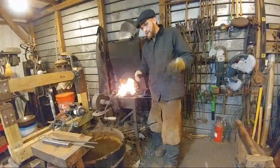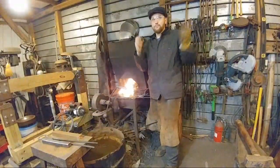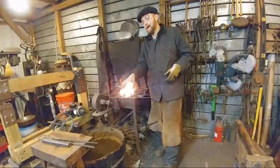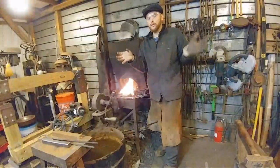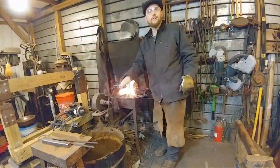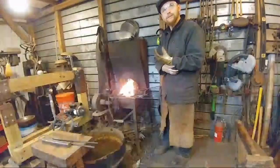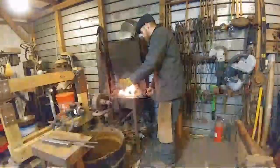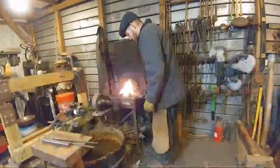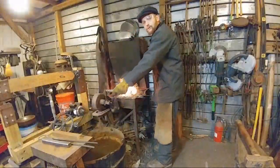But they do get really hot. The one thing I don't like about them is they do put off a lot of noxious gases out of the front end of them. You've got to vent them properly and or have them in a really open area. And so for those, I kind of got a mixed feeling on those. Maybe if I was doing big chunks of steel that I really needed to get hot, like welding temp, I'd do that. Yeah, For the Honor Forge says that he's considering making one for casting because of the cost of coal in Southern California. Yeah, that would probably be a good idea then.